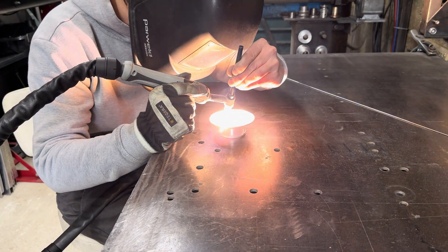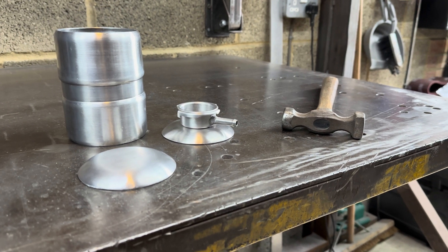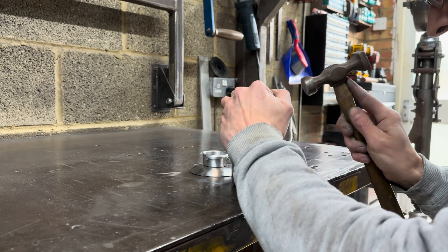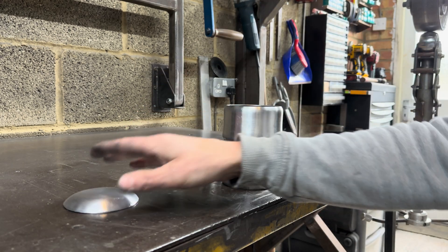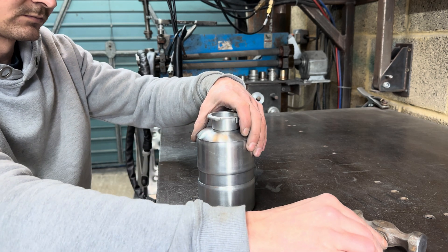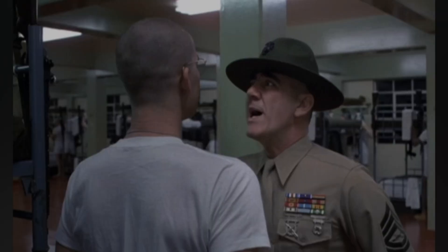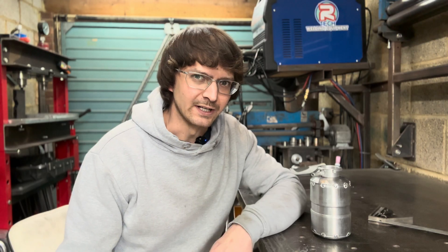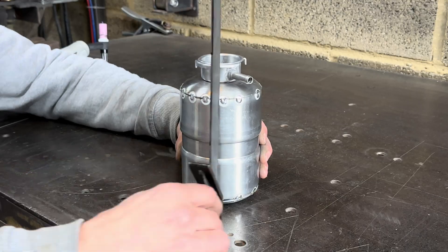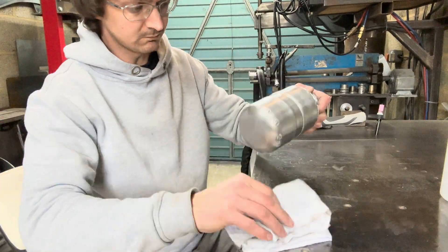With this being a rather critical part of the tank, I tend to go back over this weld to ensure the joint is fully fused. And that is one fully welded top cap. Now all the main body is formed, we need to do what I like to call fitment finessing — simply lowering any high spots in the pressing to remove any gaps that may show up whilst welding. With all of our main parts now ready, it's time to get this all tacked up. Rather annoyingly, I've just tacked this all up and forgot to press record. The gist of it is making sure the caps are square. Now the body is fully tacked up, it's time for a quick clean down and then we're on to welding.